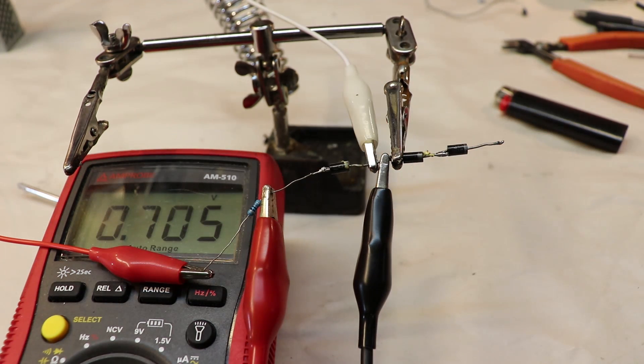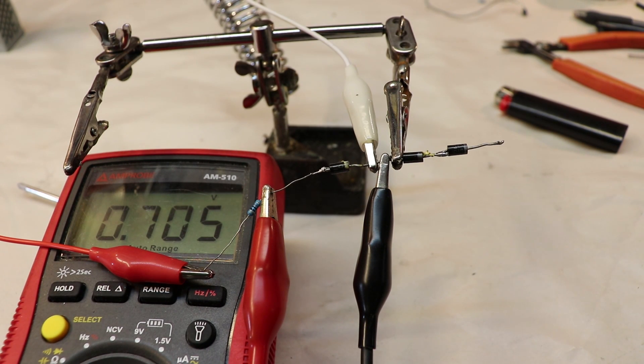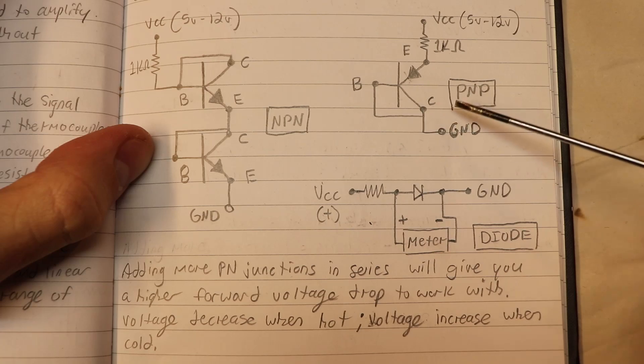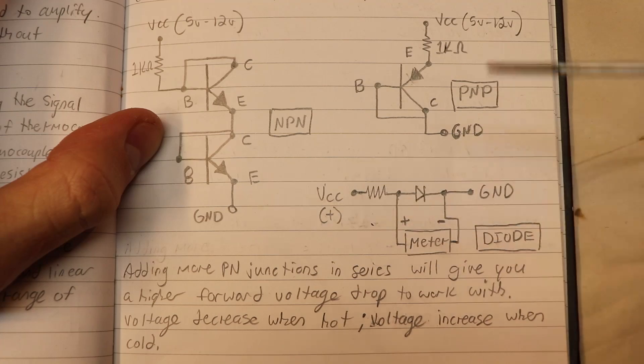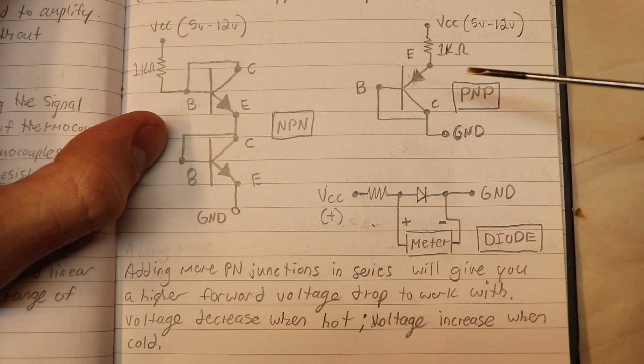The coefficient — basically the relationship between this forward voltage and the temperature — is approximately 2.2 millivolts per 1 degree Celsius. If you plot this on a line graph, you would see that it's fairly linear, meaning we can take advantage of and exploit this feature to allow us to measure temperature. You can do this with transistors as well, whether it be PNP or NPN — it doesn't really matter, because pretty much every single semiconductor device has a PN junction. It just depends on how you connect your device to make it act as a diode.